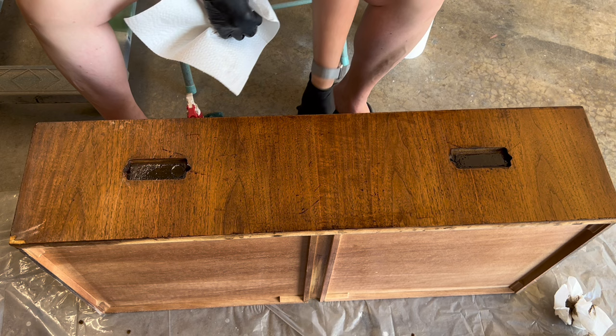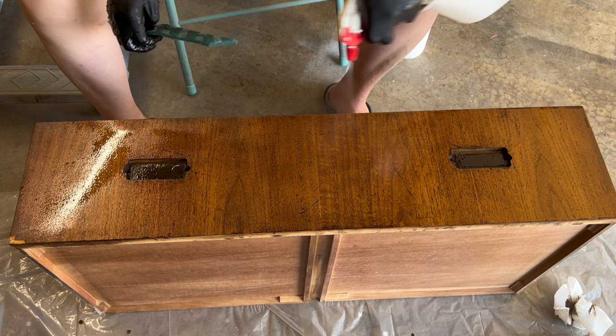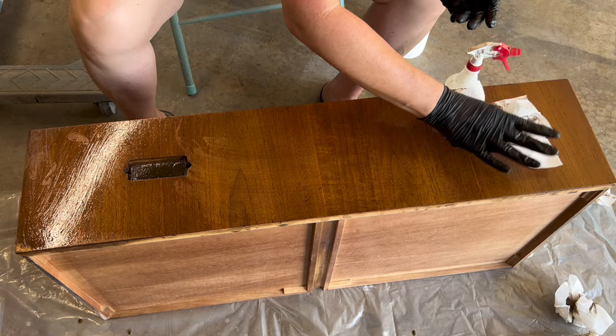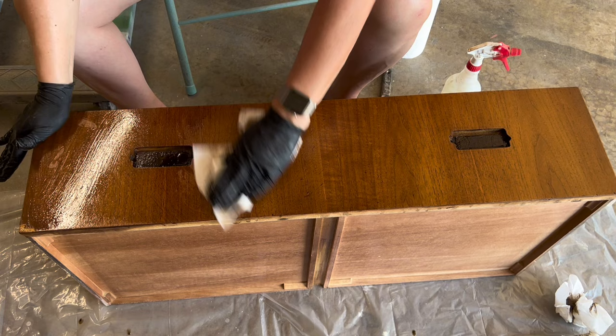It's fabulous. It doesn't work on every single finish, but what I've started doing with QCS is I'll do a test spot on it. So maybe on a part of a dresser, I'll do the spray, wait, do another spray, and then scrape it and see if it'll work before I spray it all over the dresser, because there's no need to waste product.